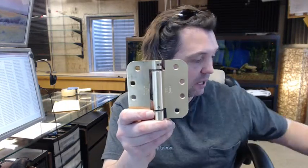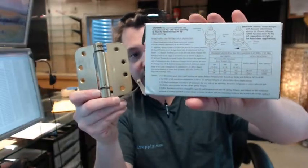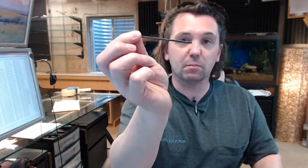There is a link below this video to the installation instructions. Most likely you're going to get your hinges in a box like this, and they're printed right on the back. The bottom line is it's simple. You're going to get a tension rod. It's a piece of black steel. This is a tension collar. Install this so that it's pointed towards the top of the door and frame. This is non-handed. You can use it for left hand or for right hand openings.